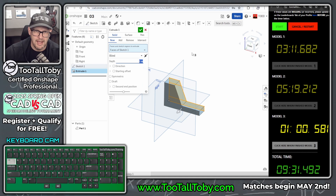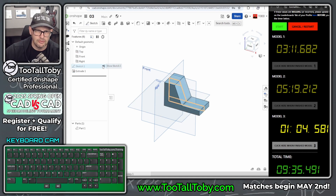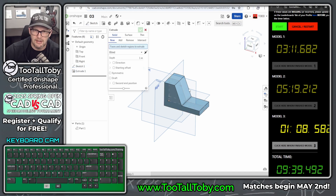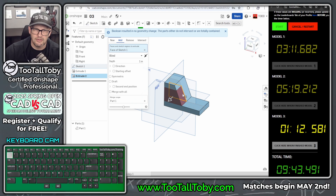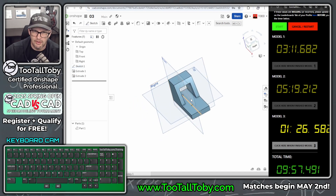Using Tab and Space shortcuts to finish the extrusion quickly. Then show the sketch and create another extrusion — pressing the Tilde key to pick the region on the inside — cut extrude to 1.25 inches, symmetric. That gives us the cutaway on the inside and sets us up nicely for the next feature.